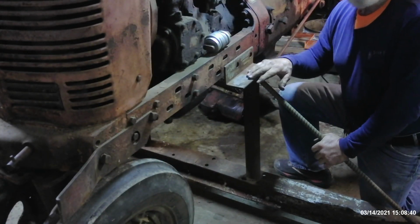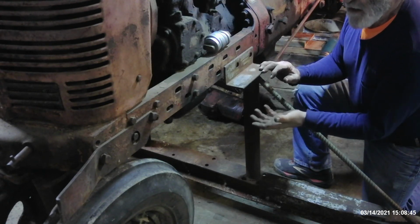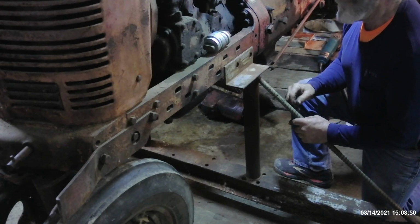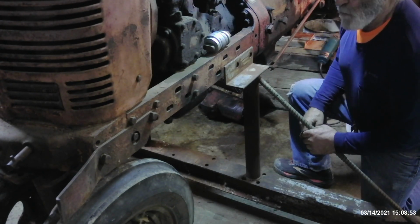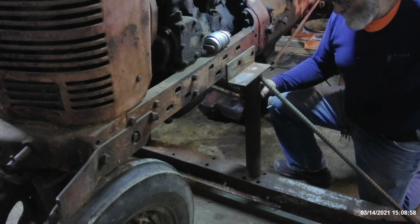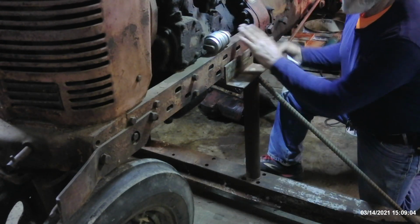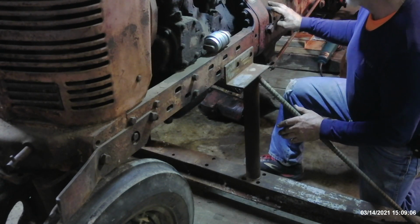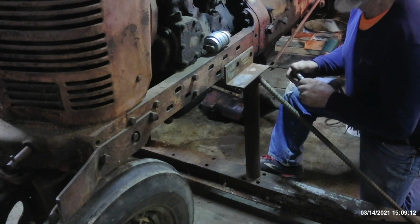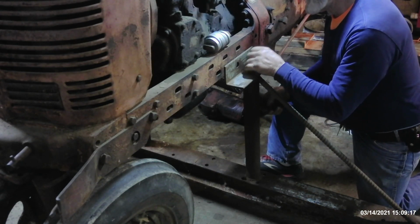Normally what I do whenever I split a tractor is I go out to the overhead hoist. I've got chain falls and everything that allow me to lift up the front end and the back end separately, and then roll them forward and backwards, maintaining whatever level that I want. But the weather is too iffy right now this time of year, so I'm opting to borrow this from my much older brother, and I'm going to rig this up right here, to where this is going to support the entire front end and the torque tube as I pull it forward, and we'll let the blocks of wood and everything support the actual transmission and final drive. So what we've got to do is center this up somewhat.